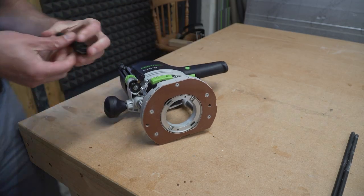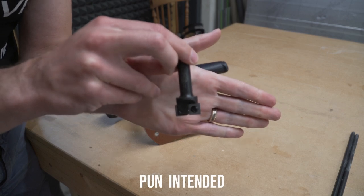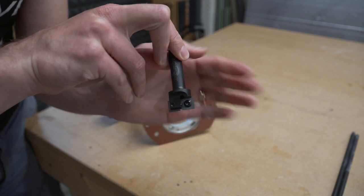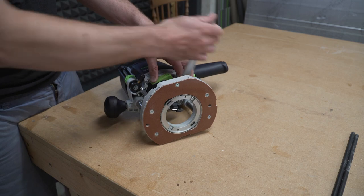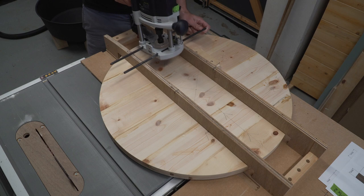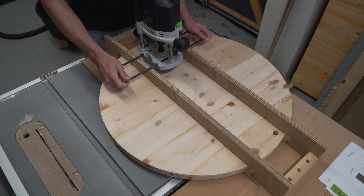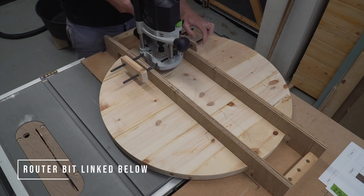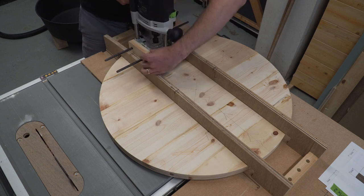For the router bit we used this one-inch surfacing bit. We shopped around a bit for the right cutter — it was important that it was able to cut when plunging as well as in horizontal movement. Our thinking was that a one-inch cutter was probably safer than anything larger, and given we were unsure how much abuse the cutter might experience, we thought it important to get something higher quality. Speaking with the benefit of hindsight, I can thoroughly recommend this cutter. And with the rails on the router, we just need to add these spacers that keep the router centred between the rails, and we are good to go!